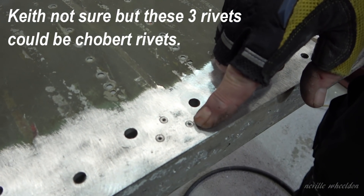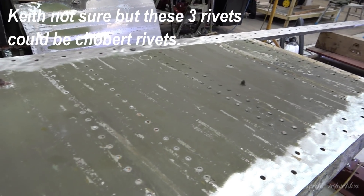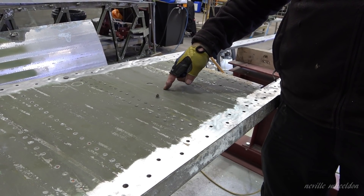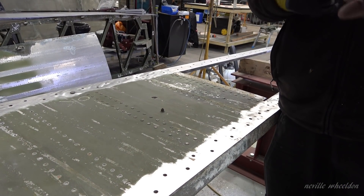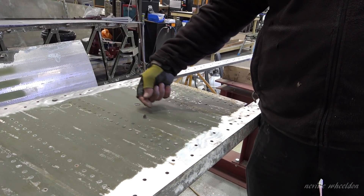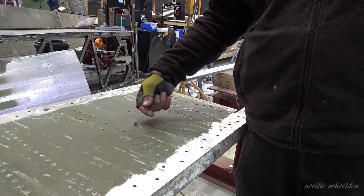The rivet does have a head — it looks exactly the same, a hollow rivet. They're countersunk. It's like a normal shaped rivet but hollow, and once the mandrel falls through it, it flares and enlarges the rivet into the hole so it grips. And then what you do is, if you need the rivet kind of watertight or whatever, you can drive an aluminium pin in.